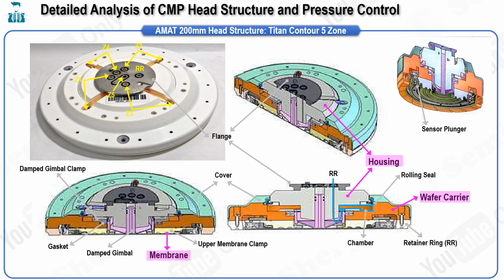This part is attached to the spindle, which is responsible for rotating the entire head. The housing includes a flange, which is the part that clamps the spindle to the head, ensuring a secure and stable connection. The flange features 6 ports that connect to the rotary union, allowing the air path to continue through the system. Within the flange, you can observe 6 holes that are designed to receive air pressure.